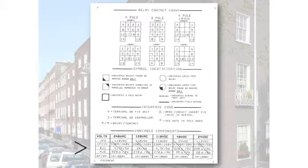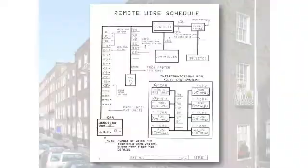The difference between 24 and 240 is drastic. In fact, we're using a 12-volt relay here. In 110, we use a 110-volt relay, and in 240, we use a 110-volt relay. This is in case something isn't working, you can verify what should have been mounted in the board. We started doing this a long time ago because we used to build a lot of these boards. And my assemblers used to screw up once in a while and end up putting the wrong component in. So this gives you a chance to verify that, if you have an issue with it.